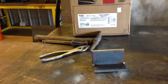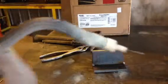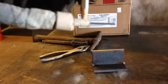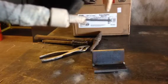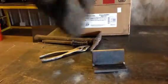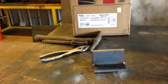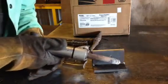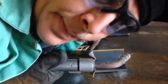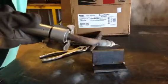So without further ado, let me break off that tip and show you one inch stick out. Here's the gun — this is the brass contact tip right there, and that's about one inch of stick out. I always start off with a clean one with no flux into the tip — it's about one inch right there. We're doing the drag technique, dragging this back kind of like stick welding, a little bit less than 90 degrees — maybe 75 degrees.